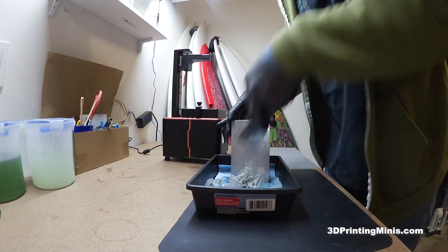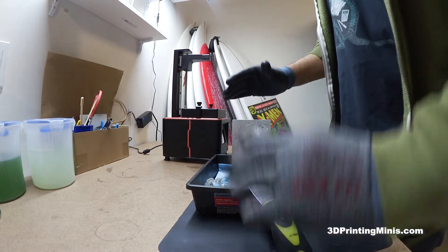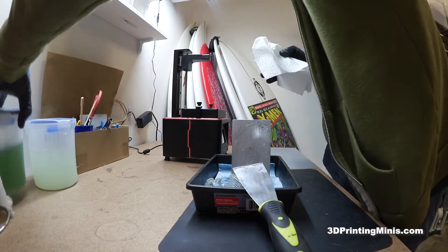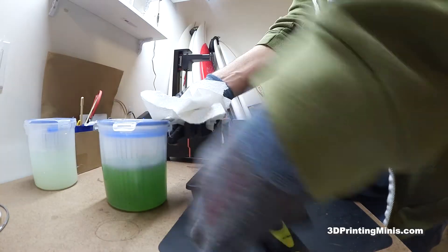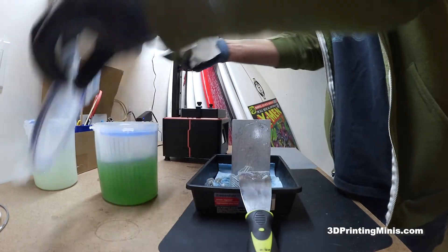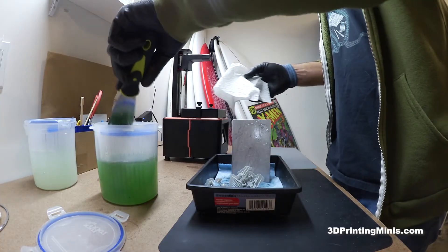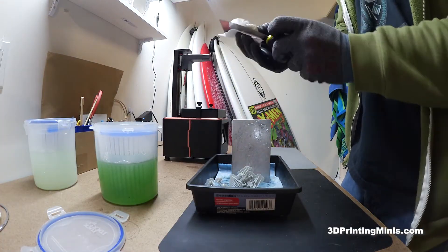When the plate's done, give it a little scrape with the scraper to get any pieces that are stuck. Usually you have a pretty clean situation. I get a paper towel. I use Mean Green as my first step for cleaning — I go Mean Green, then Mean Green in a ultrasonic bath, then a squirt bottle of ISO, then water. Four steps, but it goes pretty quickly. I have videos on that on this channel. But first, I dip the scraper in the Mean Green to rinse it and wipe it off — keep my tools nice and clean.